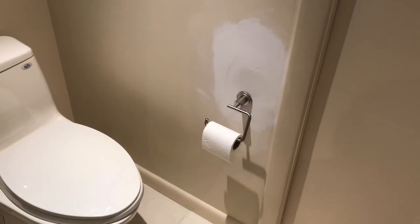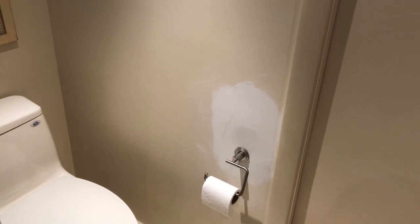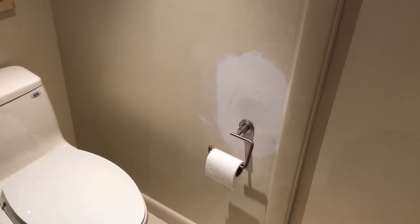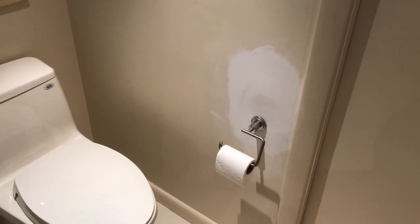Get those little imperfections with your sandpaper block — go easy. When you prime it, those tiny imperfections will fill in. It's nice and flat — feel it, look at it on angles. There you go, it's finished. Hardware's on, it's nice and smooth. Once you paint it you won't even see those marks at all. That's how you patch a hole in the wall — quick patch job.